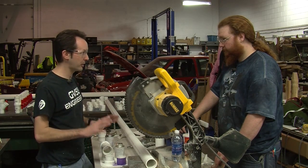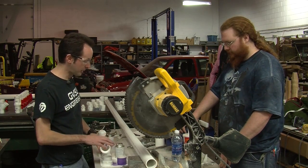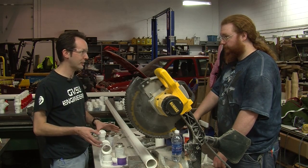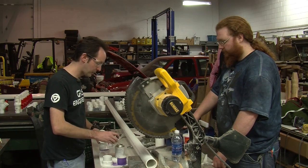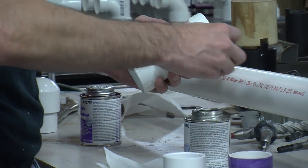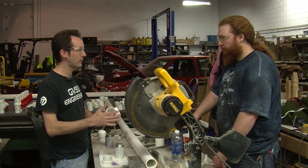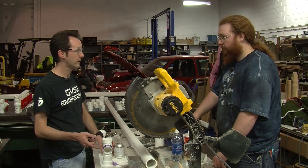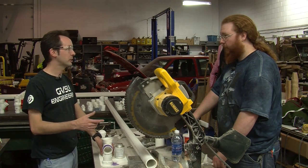Now for the glue, this is where you have to have everything ready. Make sure you have all your parts primed — we've got our female side, our male sides, and our other female side. We know exactly how it's going to go together and everything's ready. There's a bunch of debate — everybody who teaches this does it differently. This is how I do it; it may not be the official textbook way, but this is how I do it. I take my glue, run it around inside. You can't use too much glue. Take the female piece, push it in, and give it a turn — at least a quarter turn — but push hard and give it a quarter turn. Then you know you're all the way in. Leave it alone. It's done. And if you're doing this on a live system, like if this was a real drain pipe, by the time you finish that and walk across the room and flush the toilet, it's dry.